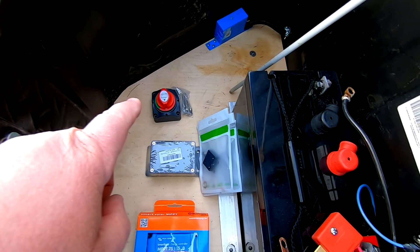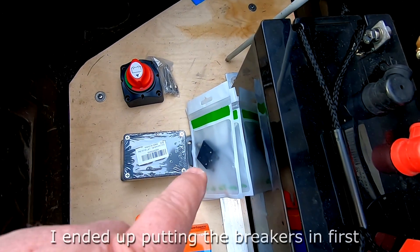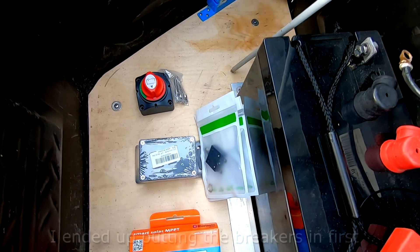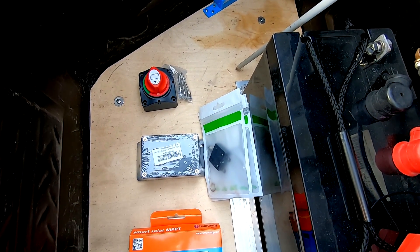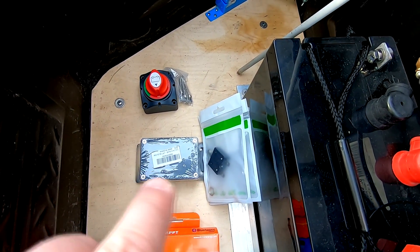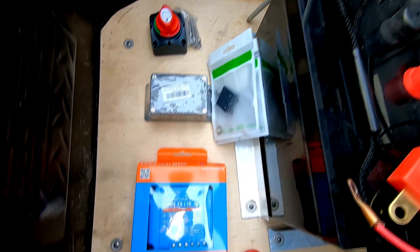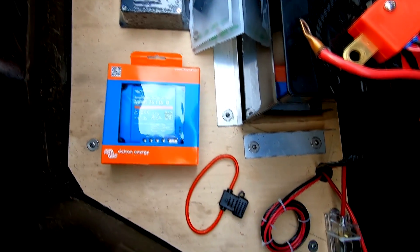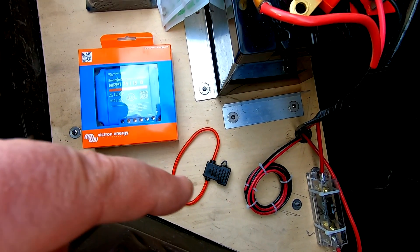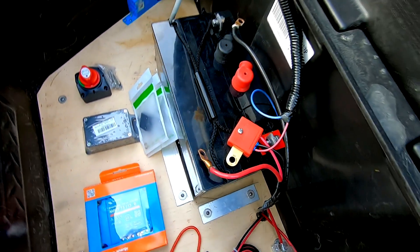From there I'm going down to either two fuses or two breakers — in my case, two breakers. These are 5-amp breakers, 50-volt, that will hold the voltage and amperage of the solar panels. I've got a little black box to mount the circuit breakers on. From there I go to my Victron charge controller, then from the charge controller to a 15-amp fuse on the hot lead over to the battery. That'll be the connection.